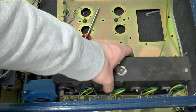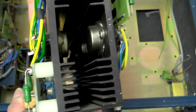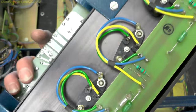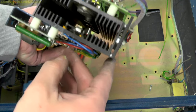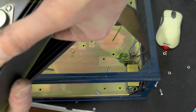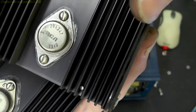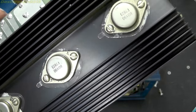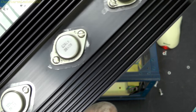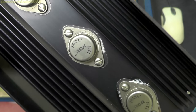And we've just got the heatsink assembly here with all the driver transistors for driving the flyback. I can see one, two, three, four on one side and one, two, three, four, five on the other, plus looks like a diode in there as well. On this side we have RCA 2N4347s dated 1979, and on this one we have BDY90s dated 1978 - those are just high current NPN transistors.